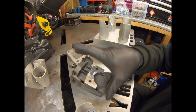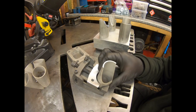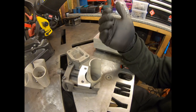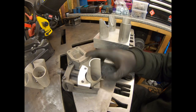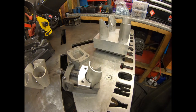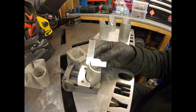So what you'll do, I'm doing 4 into 1, 1¼-inch pipe. So I'll sit my pipe anywhere in here, but I'll just show you, as I've already got one cut. This will sit in the bandsaw this way. The bandsaw will come down and make its first cut, which is that one there. And then I need to rotate it 90 degrees, going by this degree ring here. Sometimes it's a little bit off 90, but what I tend to do when I'm making a second cut is I take a square, and I'll square this up with the blade on the bandsaw.